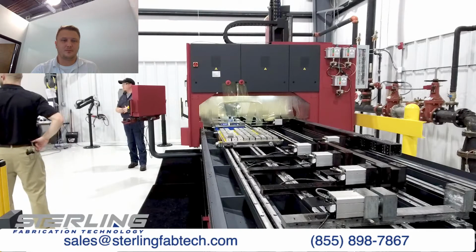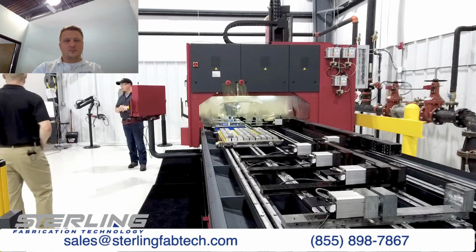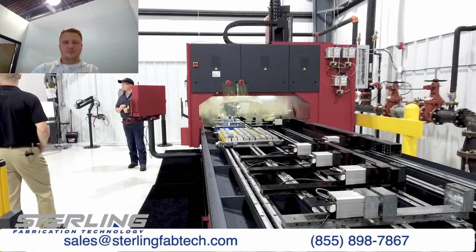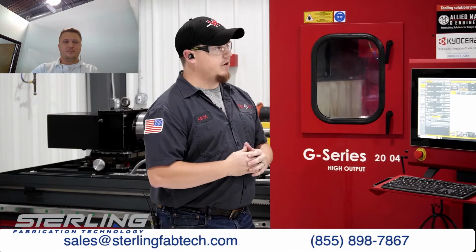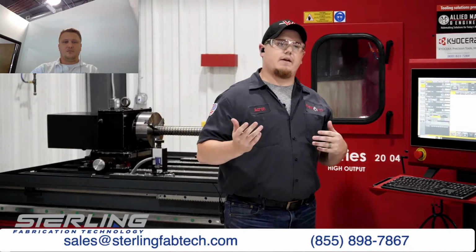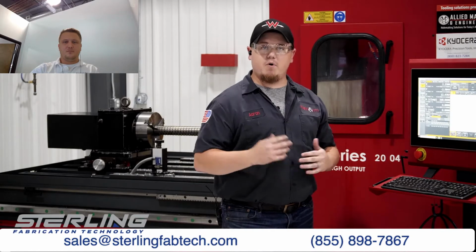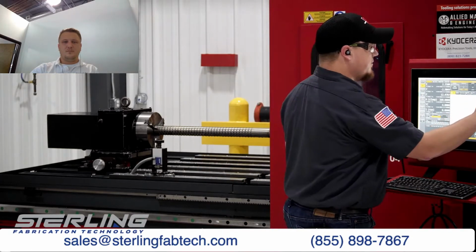that hole. Something I'll mention before we get into that program is when I made those slots on that last part, I used a solid carbide end mill. And here for this next part, when I machine the counterbore, I'm going to use a high feed mill. So time is going to be crucial. Now, if you have customers that aren't exactly concerned about the finish of their part, it's more or less just speed. One of the tools that we're going to showcase here, this is where they can really save some time.